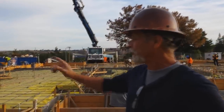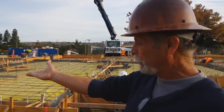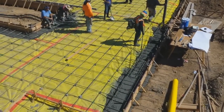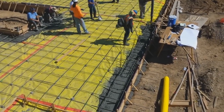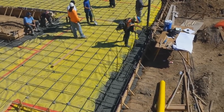We're pouring this concrete in the footings and in the slabs, but first we're going to pour it in the footings. We're going to pour it right to the bottom of the forms. That way the concrete will set up enough to hold the concrete on top from pushing out the bottom.